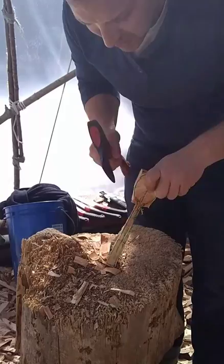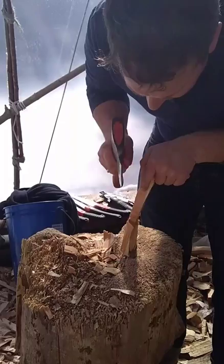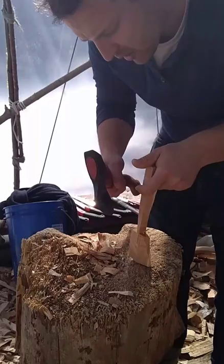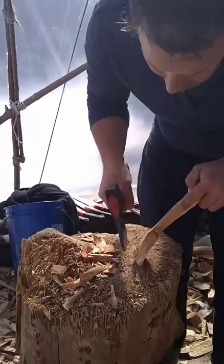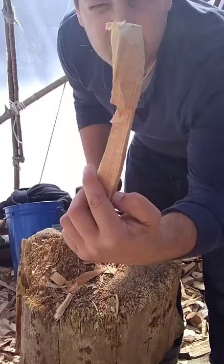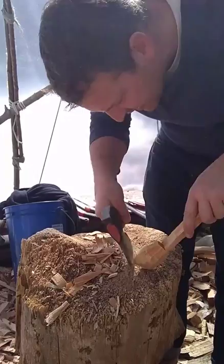And then I would say, when you're axing, try to let your axe be like a trip hammer. It's just making the same motion over and over and over again, and you're moving the spoon underneath it to achieve the different curves that you want. That also means that the axe is hitting the same place. If you want it to hit the same place, it can hit the same place again and again, and that allows you to chase a chip down.